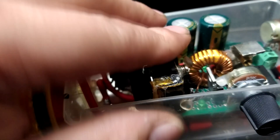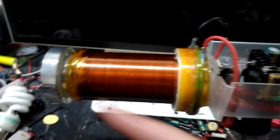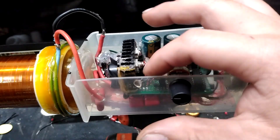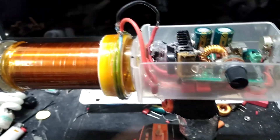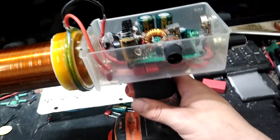I played with it for a while and the heat sink never got warm enough to kick the fan on — it's still barely warm. That fan is there because I can turn the duty pretty much all the way up and run it continuous wave off that 20 volt. I'm not sure how long I could run it like that — I feel like I'm probably overworking the capacitors by doing that, but for short periods I can. That's why I got the push button. So if you really want to start a fire, turn the duty all the way up and hit it with that straight bush, but as soon as it makes contact and pulls a flame you might risk exploding the capacitors — maybe, maybe not. It's real handy not having the boost stage; just tuning it like this, the output is still pretty good and you can have a lot of fun with it.